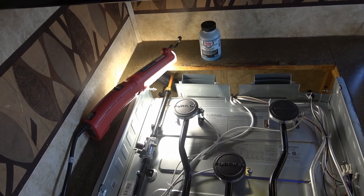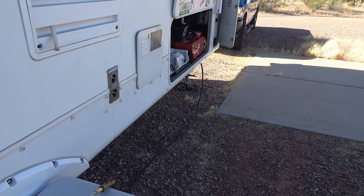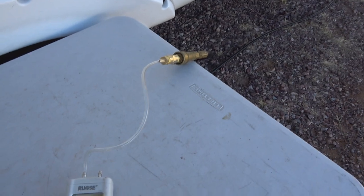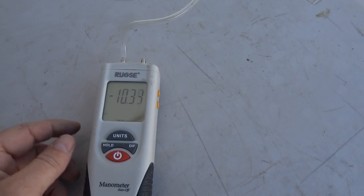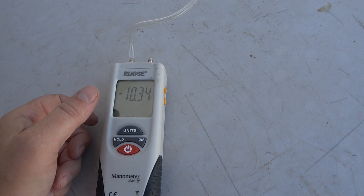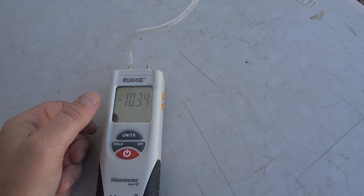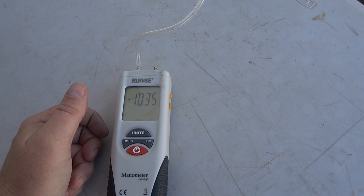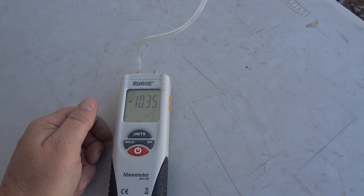One last test — I'm going to use the manometer to check the pressure and see if there's any leak in the system. I've hooked it to one of my low-pressure ports they use for a barbecue. It's reading 10.3 water columns. I'll turn off the gas, then go open a burner until it drops down to maybe seven or eight, and then let it sit. If there are any leaks it'll keep dropping; if there are no leaks it'll stay at that figure. Usually you want to do it for at least three to ten minutes.